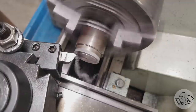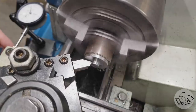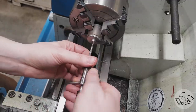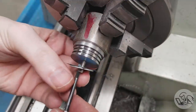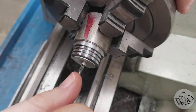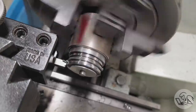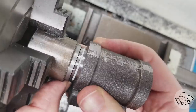To fix the grooves I'm going to need a fixture. I threw a piece of scrap in the chuck, faced off the end, turned down the OD to fit the recess in one end of the piston, then center drilled, drilled, and tapped the end for a small bolt — 5-40, which it was already sized for. I put a piece of emery paper rough-side out to protect the part and give better grip on the flat washer — an old-school trick for turning flat parts. I check it with an indicator and it's within a couple of tenths — great concentricity. Now I can go in and deepen those grooves, deepening a couple thou at a time until the piston fit felt right.